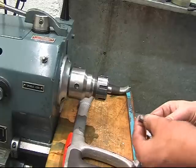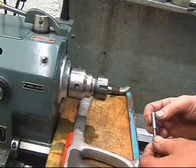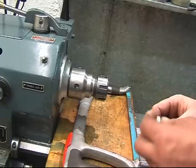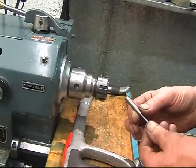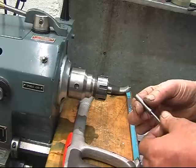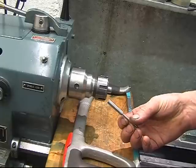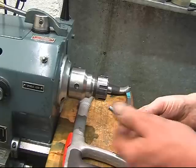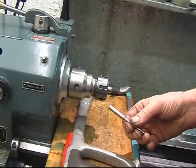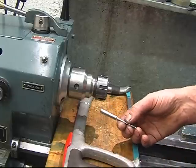The end of this will be machined up, and then it gets machined with a wedge that fits into the gear, and then we can harden that. Doesn't really need to be hardened, but it's silver steel. I can harden it, so I might as well. It's hardened by heating it up to a red heat. You quench it in water, that makes it fully hard, what they call glass hard. And you polish it again, and you warm it up. You see the colour start to run, looking for a blue colour, and then you quench it again.